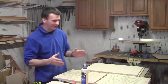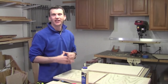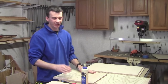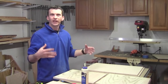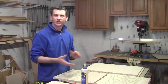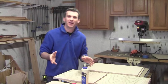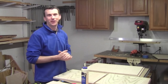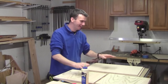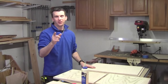All the panels are cut and rabbeted — ready to go. I went ahead and sanded each of the panels up to 180, which will be good for the inside of the filing cabinet. When the case is together and ready for finish, I'll give it a final sanding up to about 220 before putting the finish on. I'll be happy when this shop gets its assembly bench built so my poor table saw doesn't have to be used as an assembly bench anymore. Let's go ahead and get this glued together, and while it's gluing we'll start working on the two drawers.